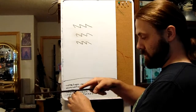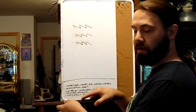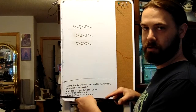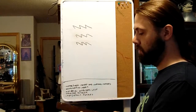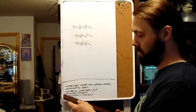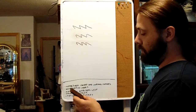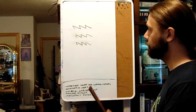But the key is just that I always go with, and I see people sawing away at stuff with a file, just don't do that. Don't back that file back up across material, and try not to file really hard metals. Hardened steel, they're not designed for that, unless you have some special file. But anyway, back to what we're talking about, sharpening these files after you clean them.